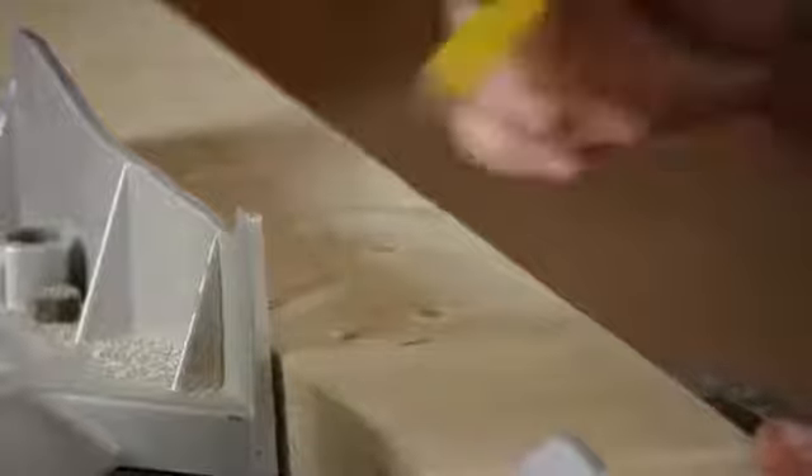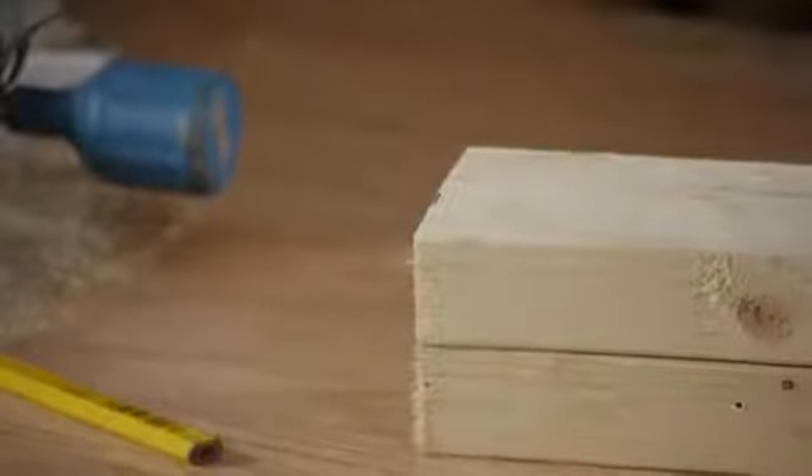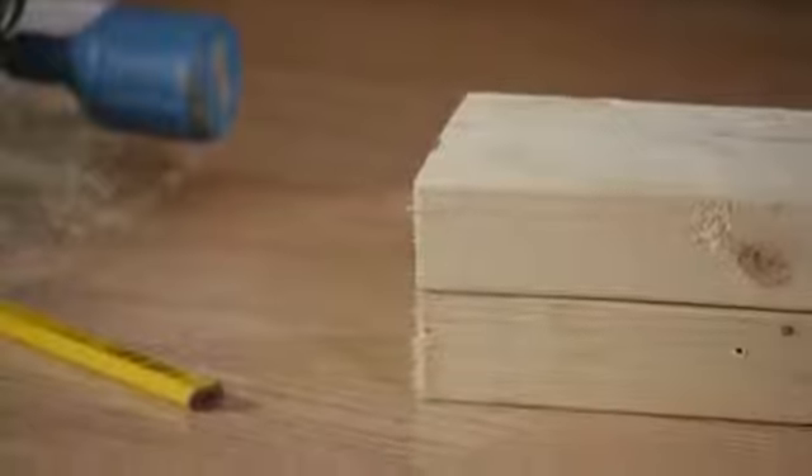One trick I use a lot is when I'm cutting a board, I like to put an X on the side that I'm going to get rid of. That way my clean side has nothing on there and I know I cut to this side of the line. The key is cutting in the same spot every time, whether it be on the right side or the left side of the line — that's what ensures all your boards are uniform. Thank you all for watching and good luck with this project.